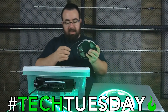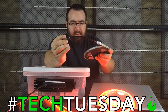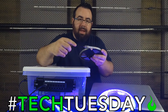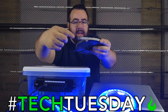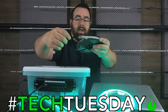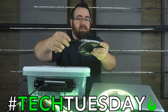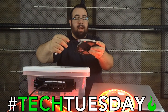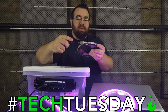The way that connects to my tape — hopefully you can see this on camera — I made these little pigtails. On one end is a CAT-6 connector that plugs into the panel. On the other end, underneath some electrical tape, I took my pairs, soldered them together, and then soldered them to a little bit of ribbon cable made for LED tape. Finally, that goes to a strip-to-wire connector I bought online — all this came from Amazon. The reason I did it this way is it means you don't have to solder directly onto the LED tape, which is a pain. You're just soldering wires together, and it's a really solid connection.